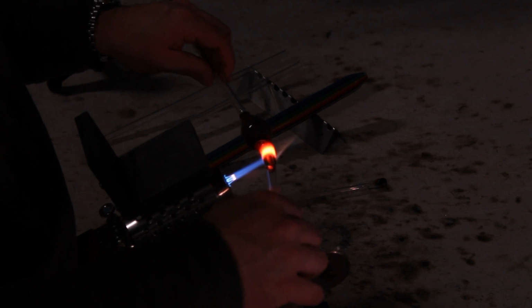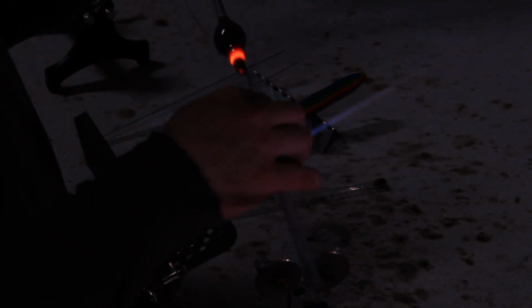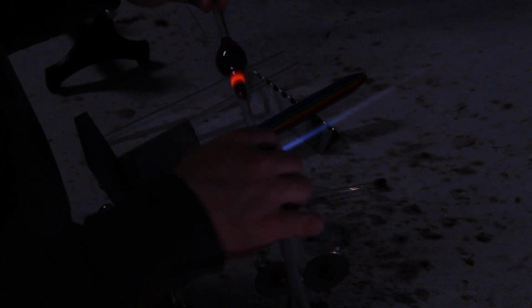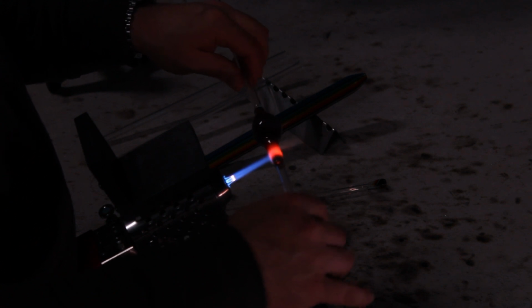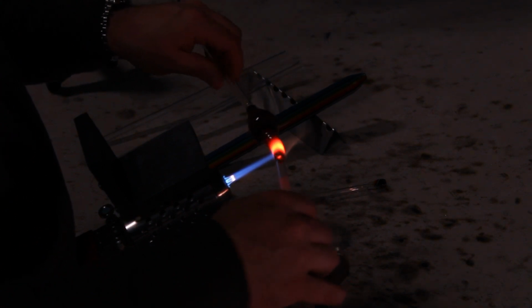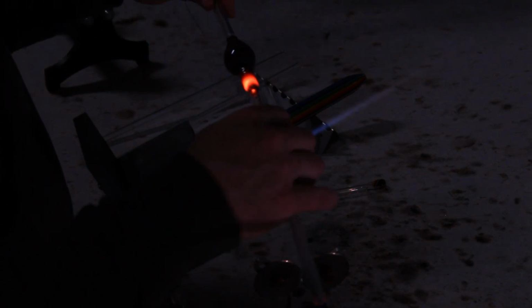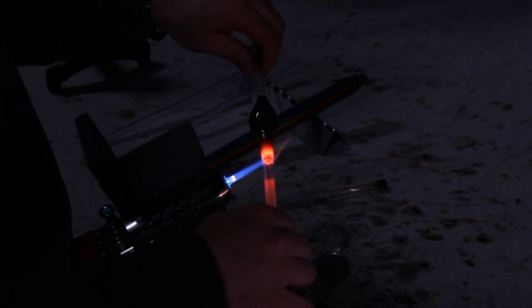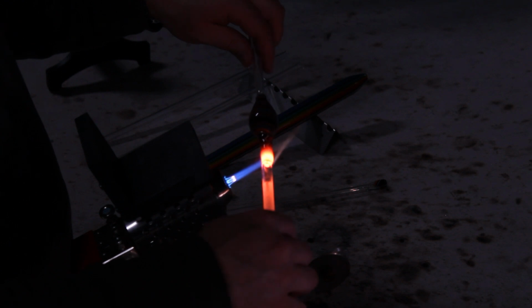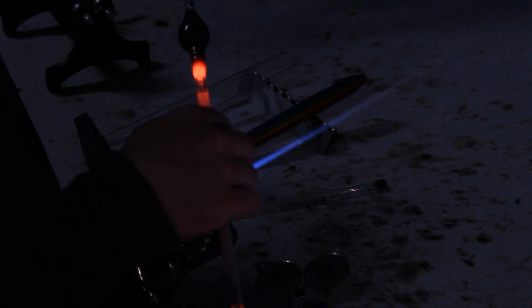twists. Both sides of the wig and the wag are happening at the same time, with the bending actually twisting the glass. This is a good technique to practice, and really shows you, in this case, I'm utilizing it to actually twist the glass, but this shows you how important it is to stay in alignment if you're not trying to twist the glass.